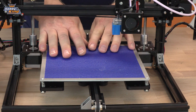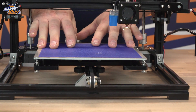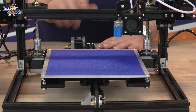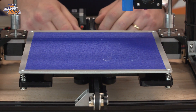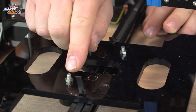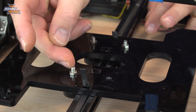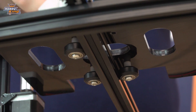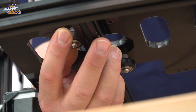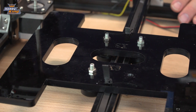When Matt was building this he noticed there was a lot of wobble in the bed, and he's evened that out pretty much — it's good enough to do printing on at the moment. I'll show you the mod that Matt and Nick worked out together. You remove these four screws to see the plate underneath. Basically you need to slot these holes so that you can move the screw slightly closer to the rail — we're talking half a mil to a mil on each side — so the wheels underneath come closer to the rail, because they were just a little too loose. It's literally one or two minutes with a file to open that hole up a bit and move the screws across.